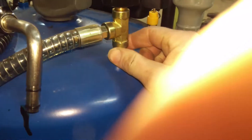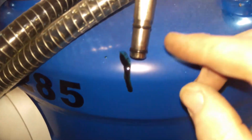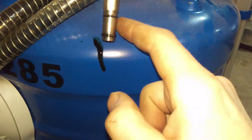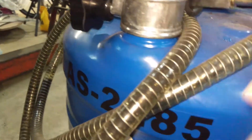Things I'm impressed with: all the fittings on the tank are quite strong — they look decent where they're attached, they don't look half-arsed. Everything on it has got two o-rings, so you've got redundancy. All these connections, with the o-rings — even on here where it goes into this tank — that's got two o-rings. I'd imagine there's probably two in here as well, I haven't had it apart.